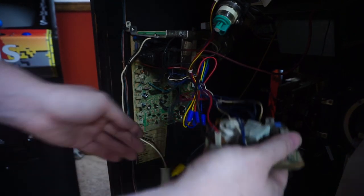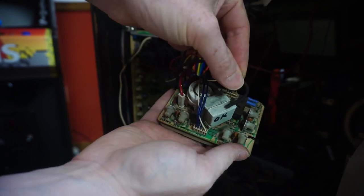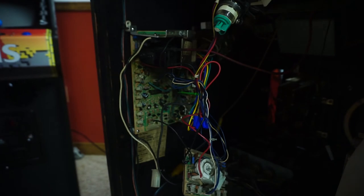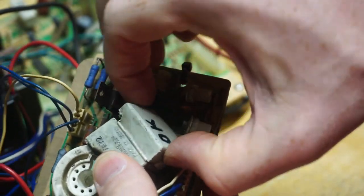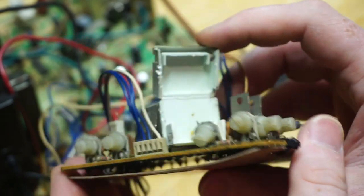But what's this black wire coming from the flyback? It's the focus wire, which should be terminated underneath this white block. It must have just worn down and broken off. I'll take the chassis to the bench to fix this, and I might as well do the rest of the wiring there anyway. Opening the cover on the CRT connector can be difficult to figure out, but it's always some variant of trying to bend some plastic out of the way without breaking it.